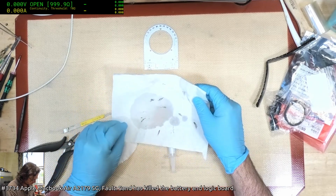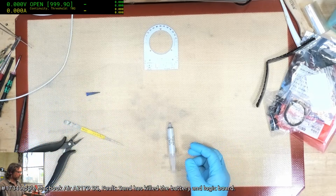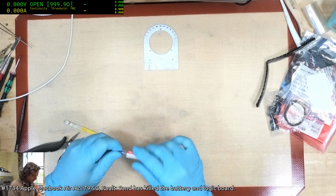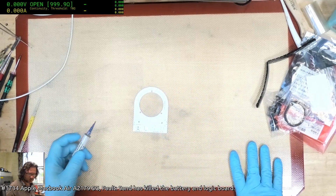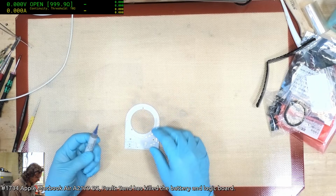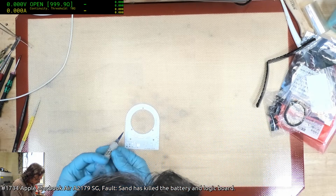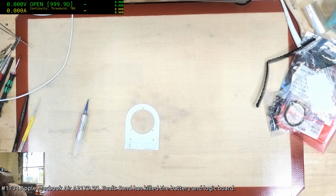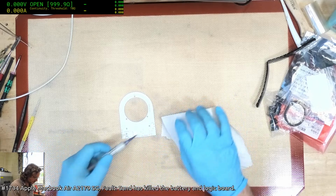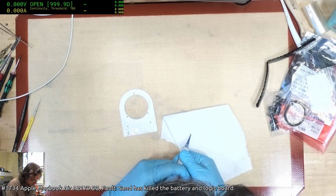Alright, this is probably gonna have to do. I promise if I start doing these at home I will get a proper stencil. I could cut one myself. I've got the mylar. I usually have done plastic or mylar stencils myself because I've got a cutting machine for them, but it's a bit of a commitment. And I'm not sure how well my mylar cutting system would do. It definitely will not do the controller chip. It will do 603s, that's no problem, but below that it becomes a bit unpredictable.